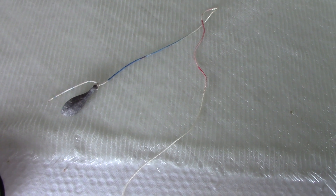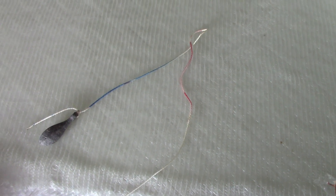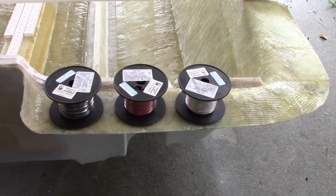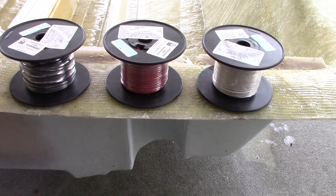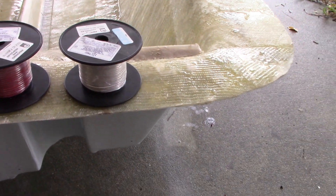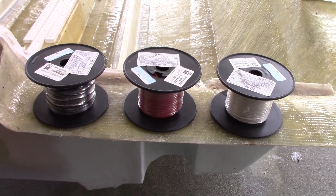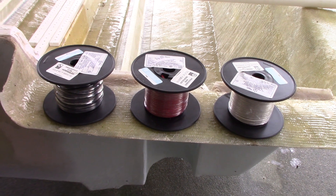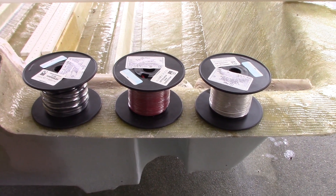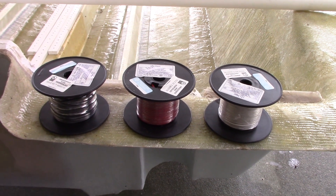A real easy way to get your wires and fuel line through PVC: just take a two-ounce sinker, tie it to a string, get your string through the PVC pipe first, and then tie everything to the string and pull it through. I've got 18-gauge marine-grade wire — red, black, and white — so I know what's what when I'm running different wires around the boat. I'm gonna have lights, bilge pumps, and maybe a fish finder. It's gonna be a pull-start engine so I've got 50 feet of each.